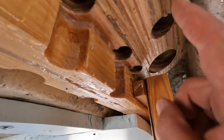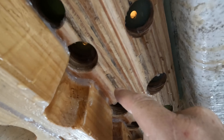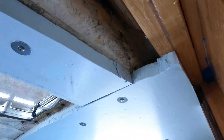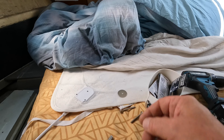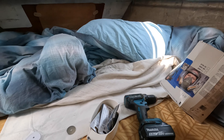Enough of the waffle, I'm going to drill these holes. There is a little bit of epoxy that's dribbled through so I'll have to put the little finger belt sander on that to clear it. You can see the holes in the FR4 where the bolts are going to go — they're blocked up with the fiberglass cloth on top. At the moment there are six of them, positioned so that we can put penny washers on the underneath. Let's get drilling.